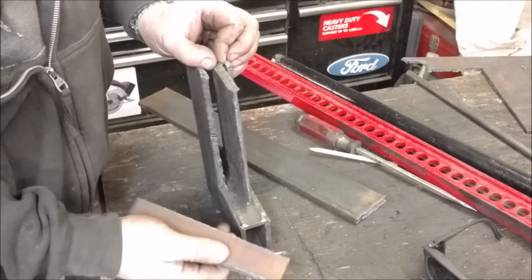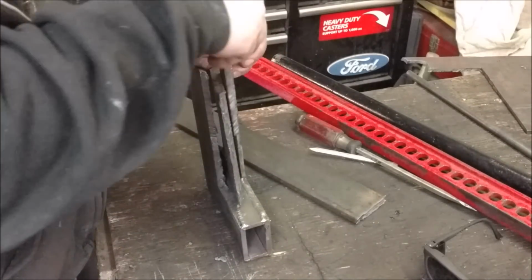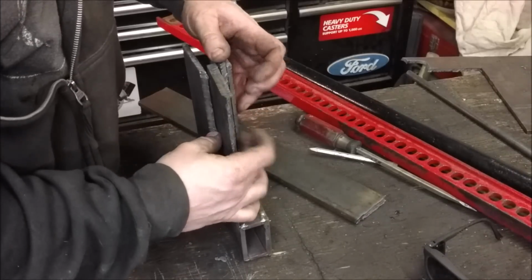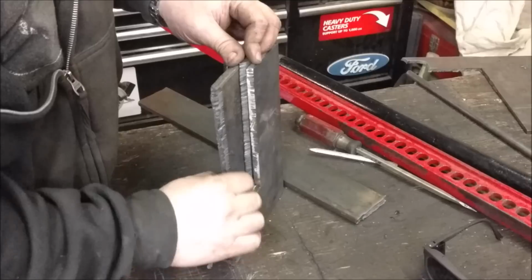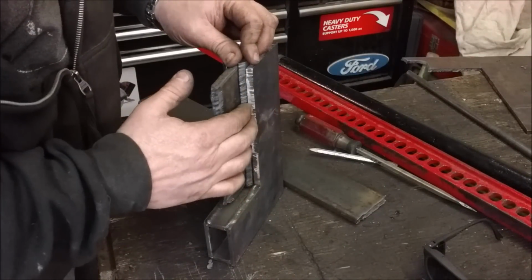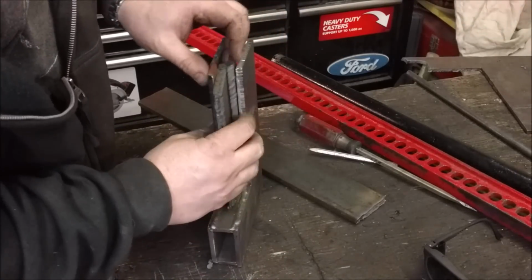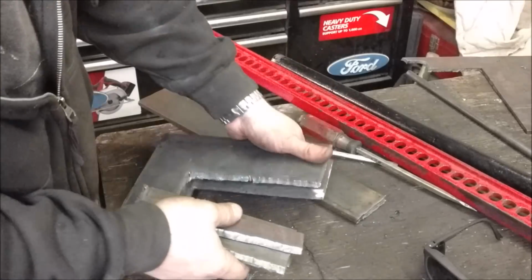And then cut 2 more shims, and they will be 1/4 inch, and they'll go on each side, probably up with this angle up here, and this will protrude, so it'll have a good inch or so, 1.5 inches of just this that splits it, and then that'll be the kicker that pops the wood apart. So just got to smooth these out a little bit with the angle grinder, and then just weld this stack of stuff in.